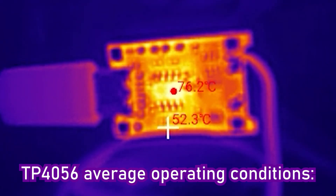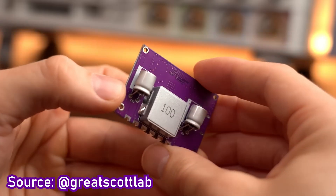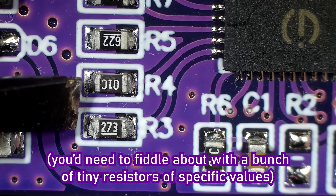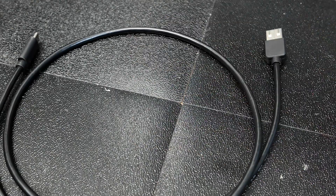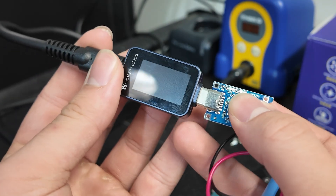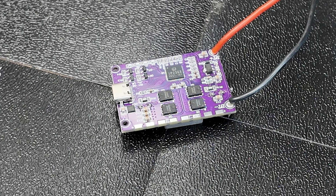And spoiler alert, it wasn't one of these, which can only handle one lithium ion cell in series. Or one of these, which, although it does support multiple lithium ion cells in series, is super annoying to configure even the limited configuration options, and also blows up if you connect a power bank's bi-directional C port on the other end of the cable. Not to mention the fact that you can't even draw the power it actually advertises. Because I wanted to do this the right way — once you get past the cable nightmare, the whole point of USB-C is that devices with the same connector are meant to work together, and safely. And the fact that the TP4056 doesn't work with a Type-C to Type-C cable, and this IP2368 straight up melts if it's connected to another bi-directional C port, makes me wonder why they even put a Type-C connector on the thing.